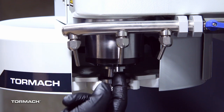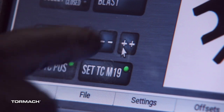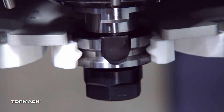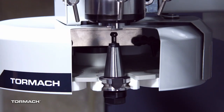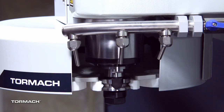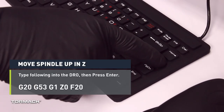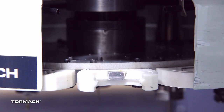Adjust for the ATC's backlash by lightly pressing forward and backward on the carousel. Then from the ATC tab select plus-plus or minus-minus until there's equal space on the front and back of the BT30 taper. Verify from the status tab the ATC tray-in LED is still illuminated. If the LED isn't illuminated, examine the tool tray — it may have exceeded the tray-in sensor during adjustment. Repeat the adjustments until the tool shank is concentric with the collet in the spindle. Move the Z-axis all the way up by using the page up key or by typing the following into the DRO, then select the enter key. Remove the tool from the ATC, then select retract.